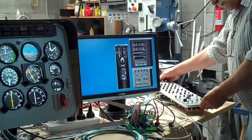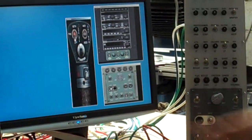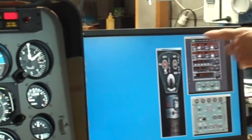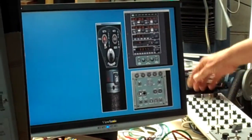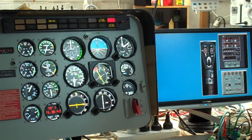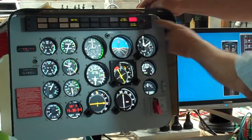Now we'll show you how some of it works. If we turn the battery on, we'll see that we get all the enunciators light up. Turn on the avionics and you'll see over on here that it shows up with the avionics. I'll just go back across here for a moment and show you the brightness. If we have a look at how bright the enunciator is now, when we flick the brightness dim switch on the avionics console — there's the brightness: dim, bright, dim. And of course we also have press-to-test up on there as well.